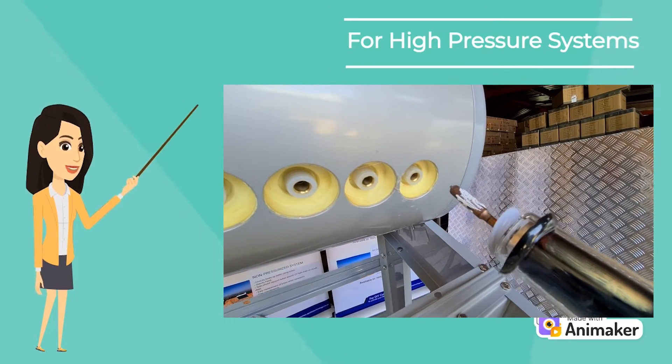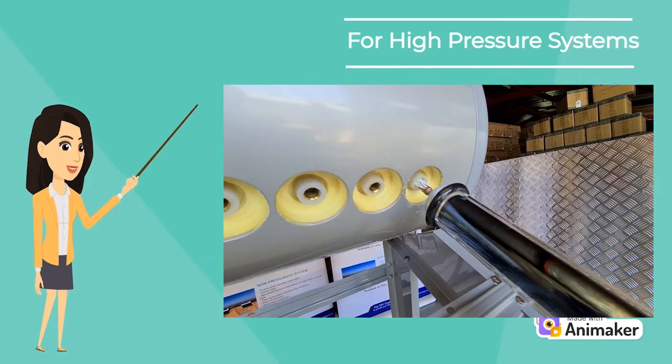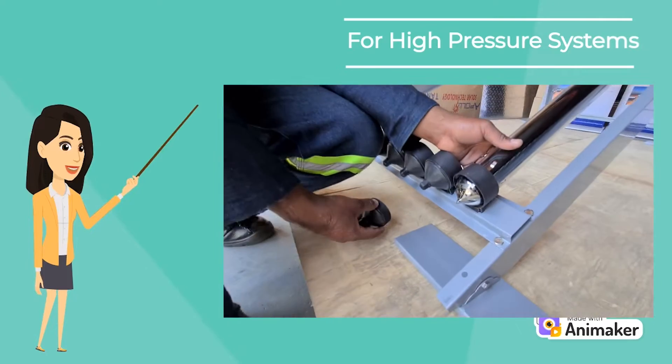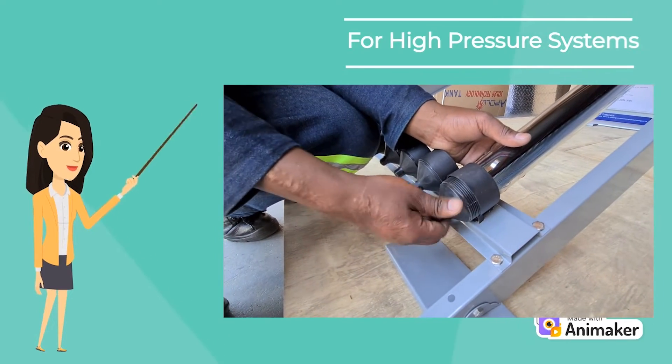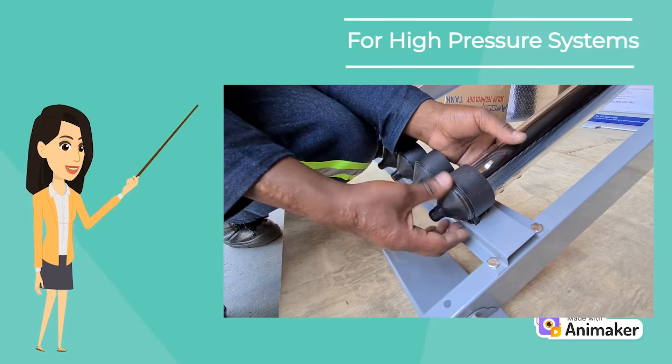Slide the vacuum tube gently into the tank. Take care that the centering silicone seal is not pushed downwards into the tube, as this will cause heat loss and inefficiencies. Finally, carefully screw the bottom of the tube holders back on.